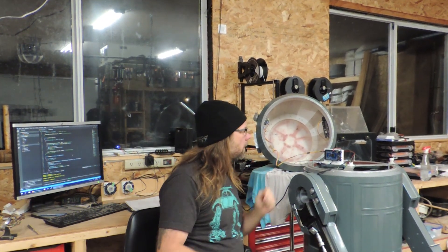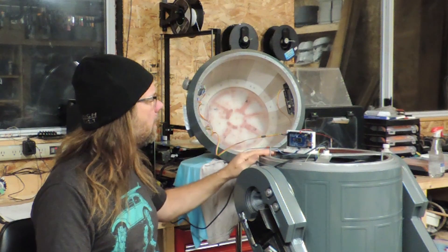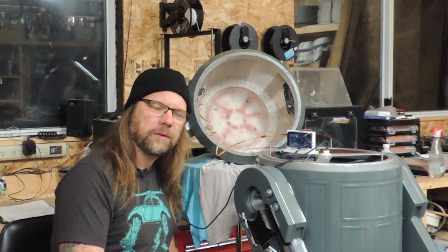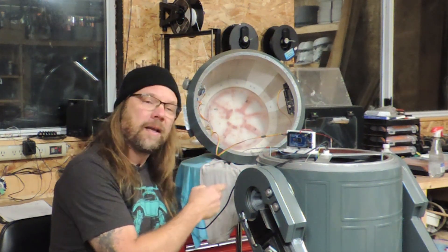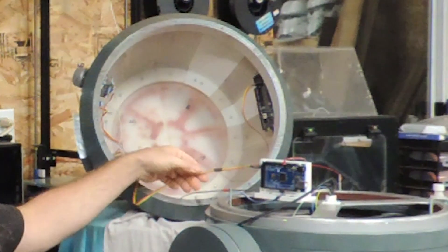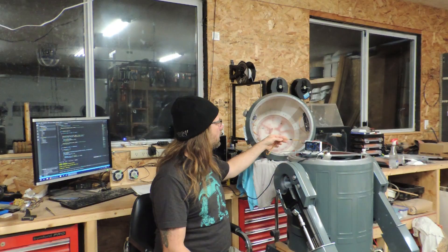I wanted to take a second to talk about something that just happened. I was wiring up the dome and getting the microcontroller all set up, and when it came time to do my first test, nothing was working. The logics were acting super erratically and the status indicator would sometimes get stuck when animating from one color to another. So I hooked my programming cable up to the Mega and spent well over an hour troubleshooting before I found a grounding issue between the controller and the LED drivers running the logic displays. Basically, it was a failed crimp in this wiring harness here.